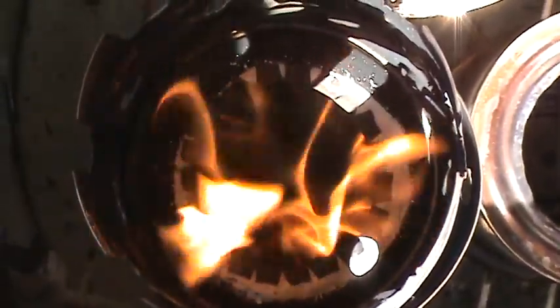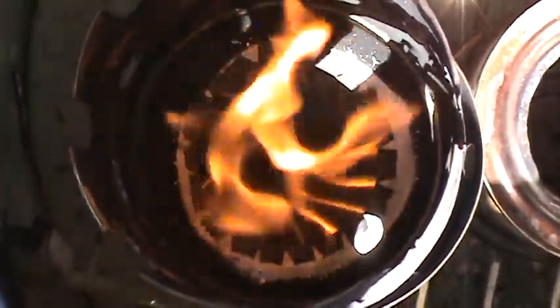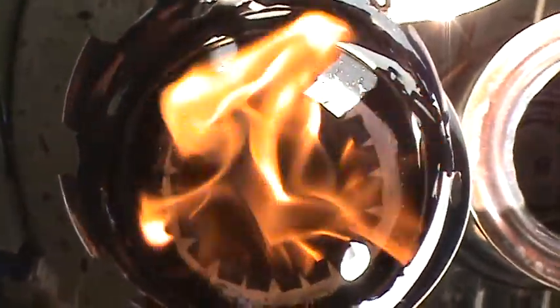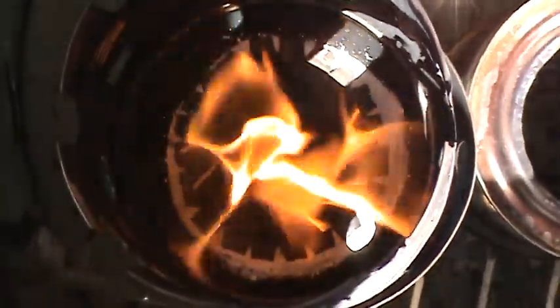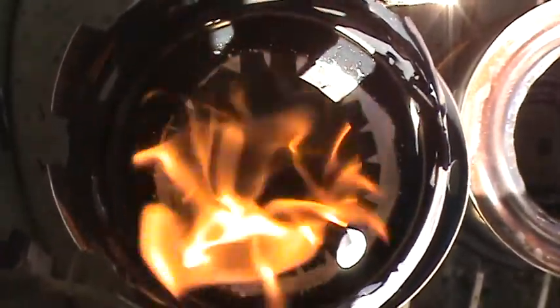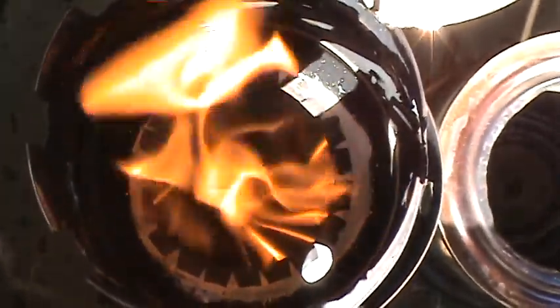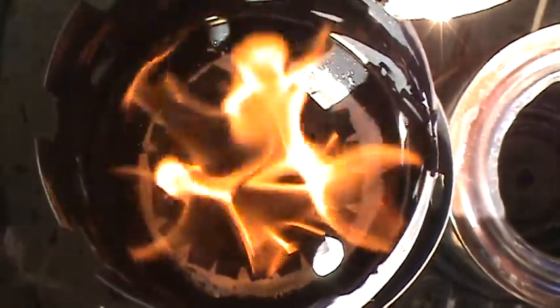The inner can is a 20 ounce fruit can, and it has 16 secondaries at the top, 5/32 of an inch, and the primaries are 32, but 16 are on the bottom on the underside of the can, and the other 16 are around the sides on the bottom. I was going to make those 1/4 inch, which they would have to be for the 5-to-1 ratio, but I decided to stop when I got to 5/32, the same as the secondaries, so basically it's like a 2-to-1.